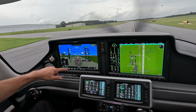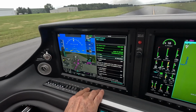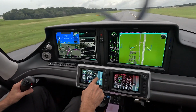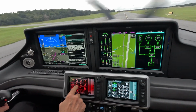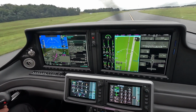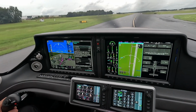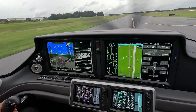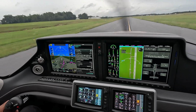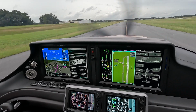And in preparation for my next flight, I'm going to split my PFD. Right? Have access to my checklist for the after landing flow. I will also split my MFD. Allowing the auto fuel selector to do its magic just before I shut the airplane down. Part of my shutdown flow will be raising up the lever to make sure that the auto swapping fuel selector feature is in the manual mode for the next start.